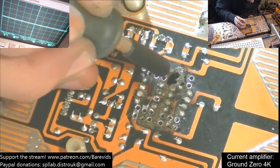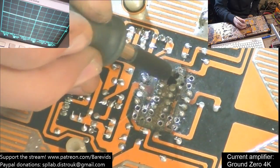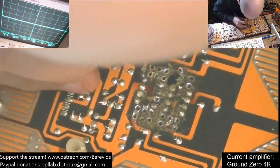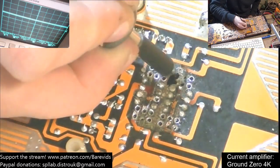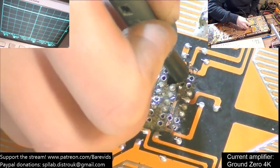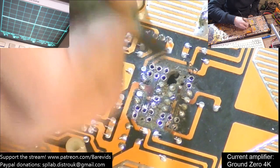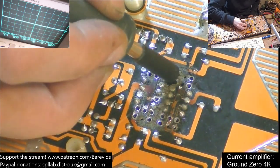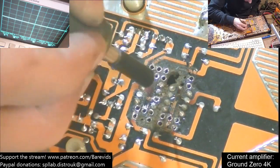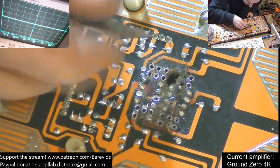Wow - I'm touching the board and look, we've got four volts on the PCB itself. We should have 14 volts on this pad here - this is pin number two of the NPNs - but it's leaking into the PCB so badly that over here it's giving us five volts. I'm going to have to cut all of this away. This amplifier either went down again because the previous repair tech didn't sort out this burnt trace area, or this happened in its most recent failure.